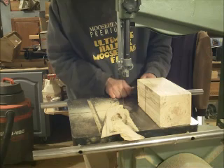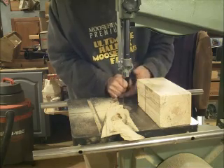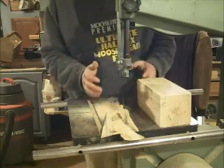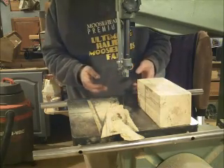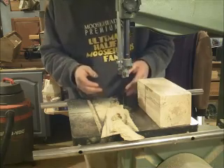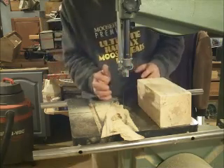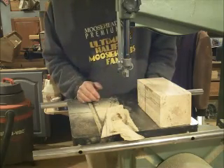If you get your fingers connected to the table and you're pushing with one finger like this, you have more of a foundation where you're not going to do the big slide. It's the big slide that gets people in trouble — on a table saw or on a band saw, it's when they trip and fall or stumble into the saw, or their hand slips off a board and makes a big push through the blade. That's the big danger point.